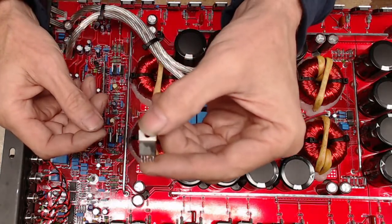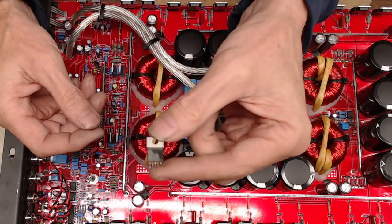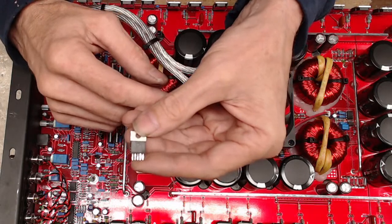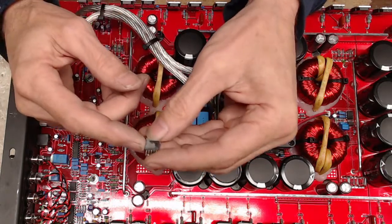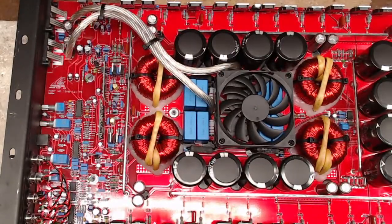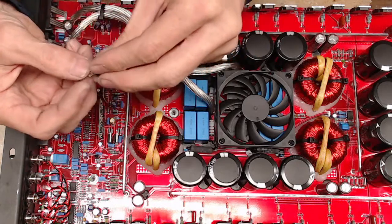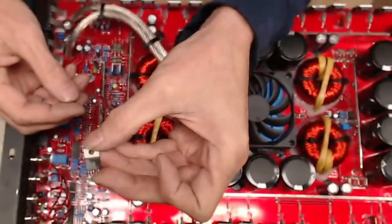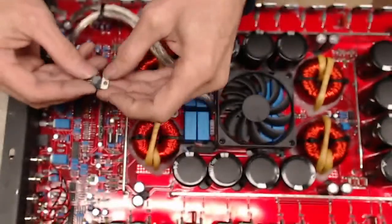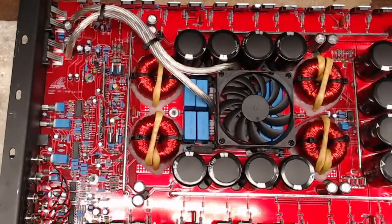This is from a DC board. And of course they defaced these. I don't even call these really ICs, but they defaced it. With some online help, people will let you know what they are. Again, they're the MIC4452ZTs. They're a TO220 style driver. Buffer, gate drive buffer.